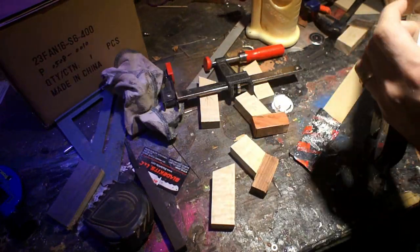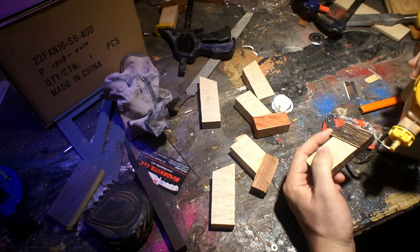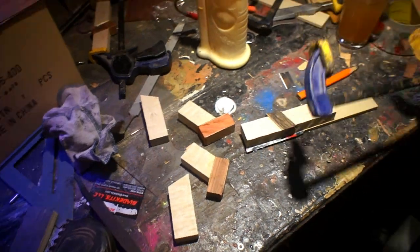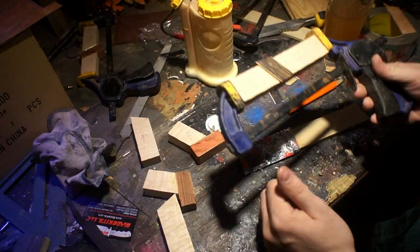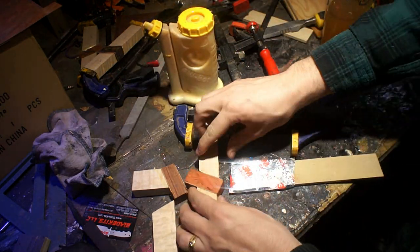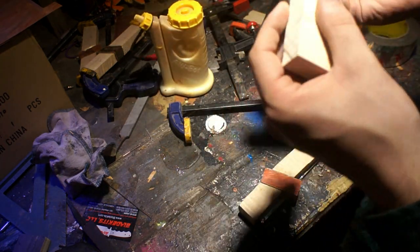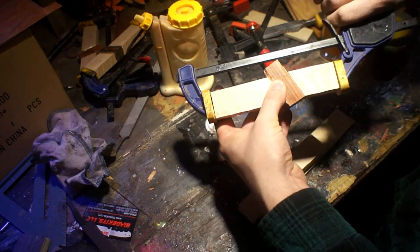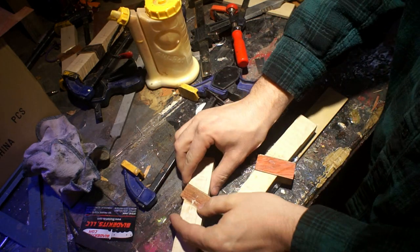The other funny thing that those angles did was to the eye — it was hard to make sure that the two pieces of maple are parallel. They didn't slide off relative to each other, and since these weren't a whole lot wider than what I needed in the final product I needed them to be pretty spot-on. I started putting them together and sticking them on a flat piece of wood that way, maintaining as much thickness as I could since I was working with relatively tight tolerances.